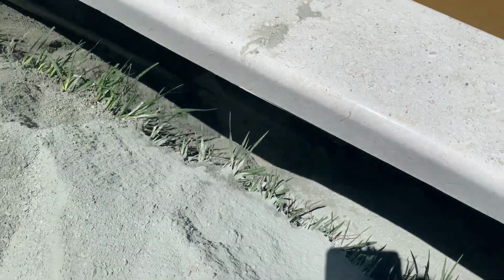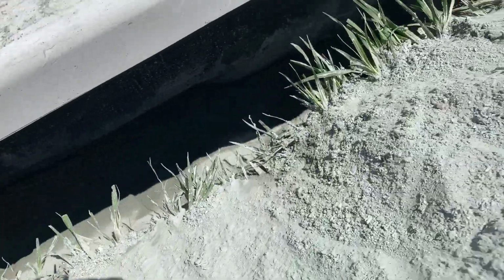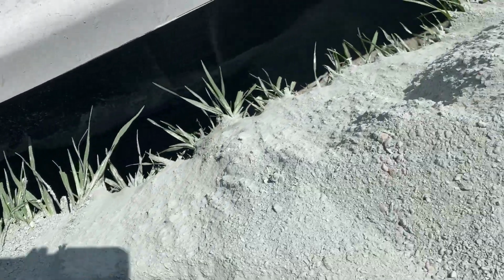It's really important that your pool's going to be in place for the next 25, 30 years. You really don't want to rush this. Take your time with it. Check the levels the next morning. You definitely want to fill the pool up and then let it settle overnight, and then check your levels again the next morning just to make sure that the pool hasn't shifted and you don't need to do a little bit more work before carrying on.